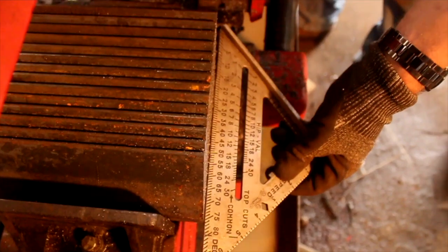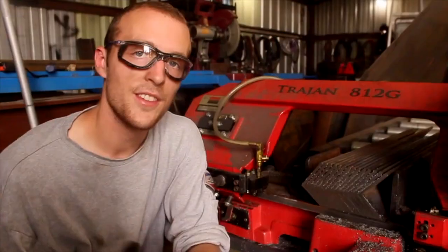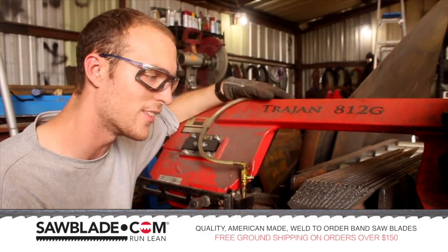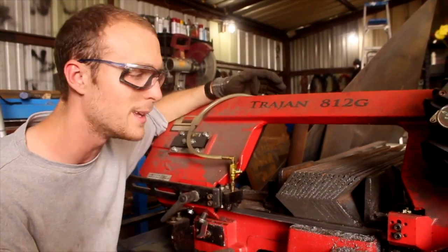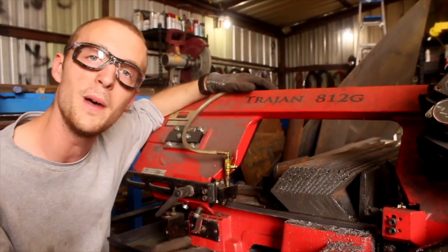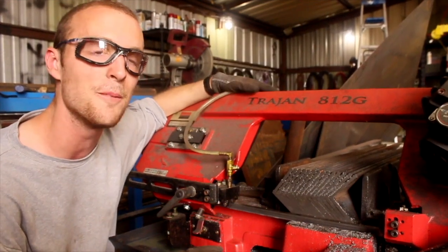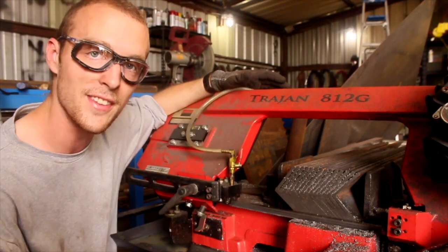Nice. As you can see, stacking material in here like this makes it so we can get extremely accurate cuts on a lot of pieces at once. Total elapsed cutting time for this section here was about eight and a half minutes, divided by these 14 pieces — that means this saw only spent about 36 seconds cutting one of these pieces. This is some fairly large, fairly thick angle iron, and the best part is I didn't even have to be here as it was cutting. I could just let this thing cut under its own force.